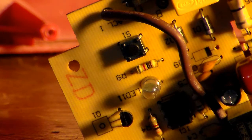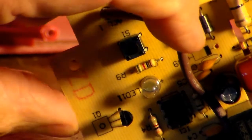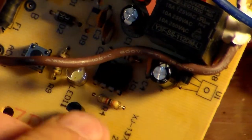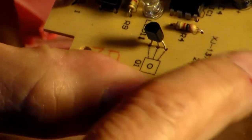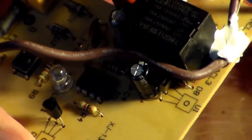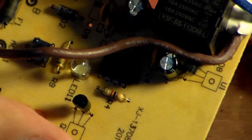Just poking around without a schematic, I checked a couple of things and it definitely seemed like it had a short somewhere — I was getting a strange 120-volt reading just about everywhere. One thing I found is this D9 right here — it's a Zener diode, and when I checked it, it showed a direct short, so I pulled it out. I'll throw another one in and check the rest of the circuit. This Q1 here would be the switch that turns the relay on and off. And this U1 over here would be a voltage regulator — I'm assuming it's a 5-volt regulator. I can see down here there's also what looks like a 555 timer or something similar.